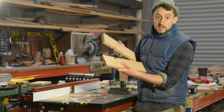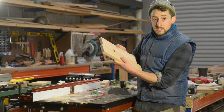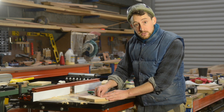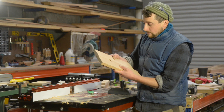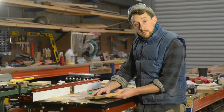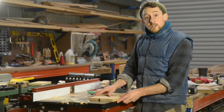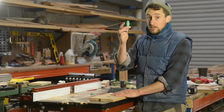We've created our dovetails and they're nice and clean — there wasn't any tear out because we were able to protect those faces. We're going to use the exact size of this to determine how big we need our butterfly to be. Because each of those dovetails was 14mm deep, the entire butterfly needs to be 28mm long. The widest part of the butterfly needs to be 19mm, and the narrowest part of the dovetail needs to be 12mm. We can use those measurements to set our placement and fence of the butterfly spline bit.